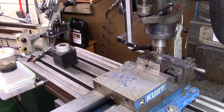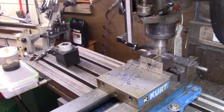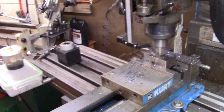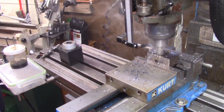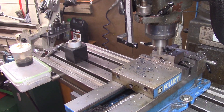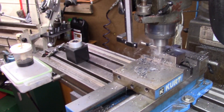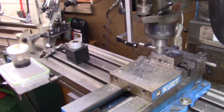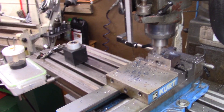Now we're going to do the — I'm going to turn it over. This has all got to be hand fed, unfortunately, because of the way this block is. We're doing the same thing we've done before — we're taking a hundred thousandths. Let's go ahead and take our first cut. Touch it, go in a hundred thousandths — that gives us some room to measure. Do all our double checks. This is the easiest way to do it. Just do your little shift and then we'll make the next cut. We'll have to do this again and then we'll start pumping this out.